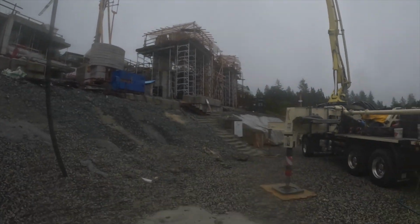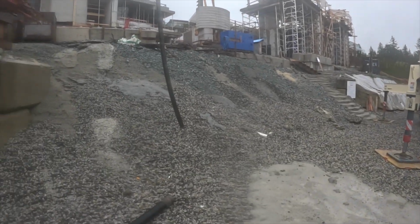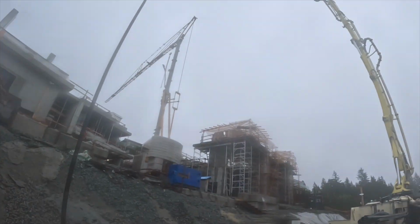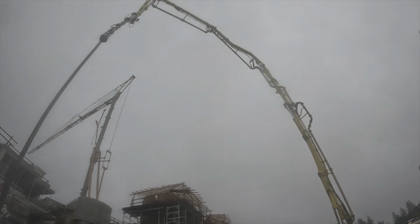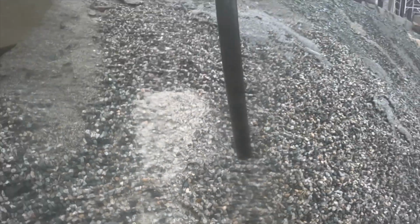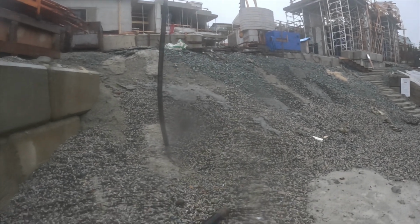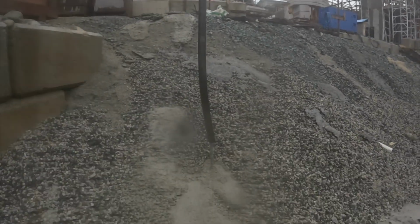50% chance it'll get through that 2-inch reducer, and a 50% chance I'll bring it down, tap it twice, and then it'll get through the reducer. Oh yeah, this is all being recorded. It shows the A-frame position here, so it can just fall. Favorable high flow priming position. Nice and slow. Oh yeah, we got air. She's coming. So wet you don't even hear it hardly, except for when the pump changes strokes. Beautiful. Air cuff on. Concrete flow off. We did it.